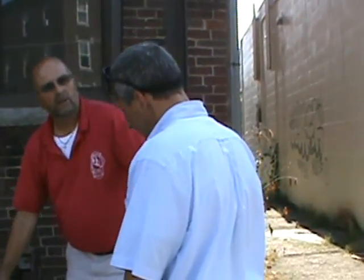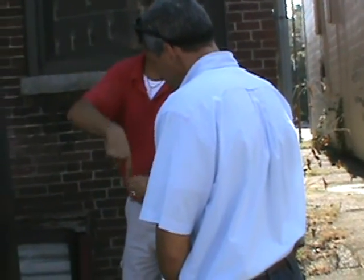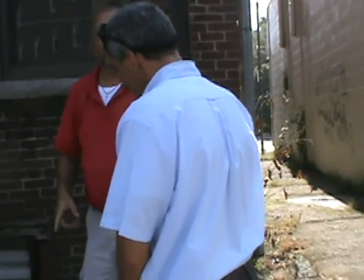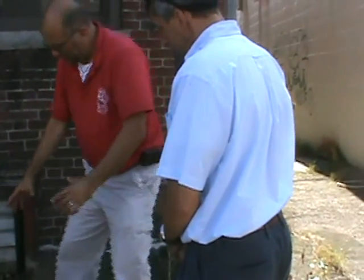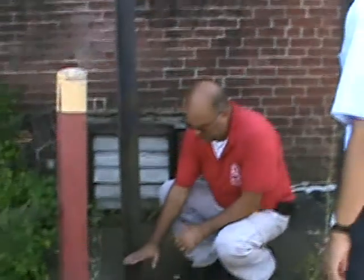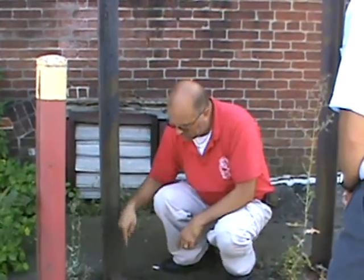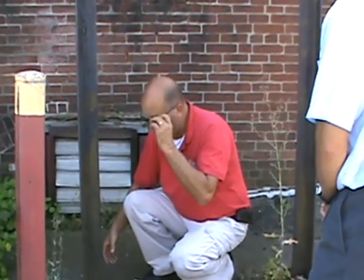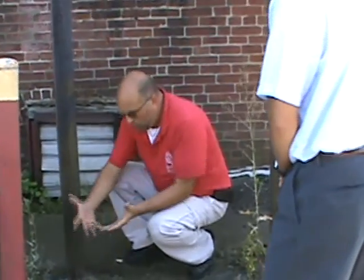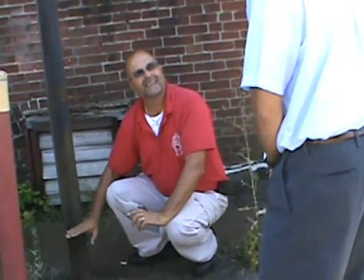Now, this thing is already in the cement. It's already wrong, because you're not supposed to put steel or wood inside cement. Building code doesn't allow it. I'm already too far gone on this one. But if I raise this 8 to 12 inches with cement, Sonotube wrapped around, I drill some holes, put a couple of rebars in the old cement to sort of marry the two together. Prior to that, I grab roofing tar and goop with my hands in a glove. I goop this whole thing up to 12 inches with tar.